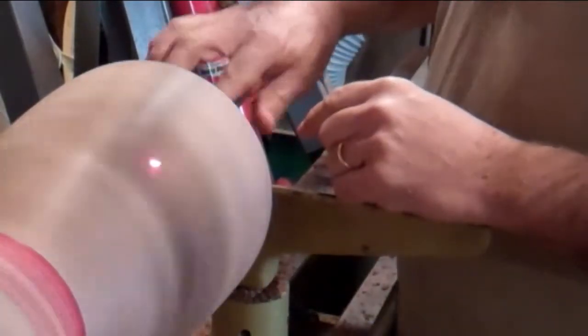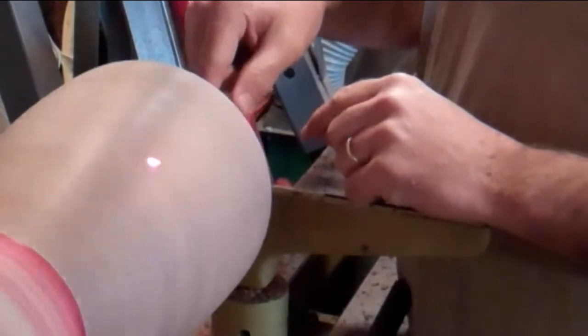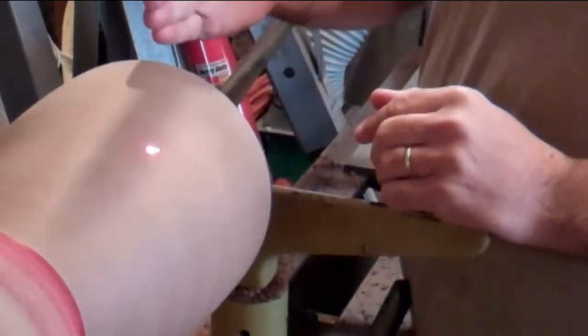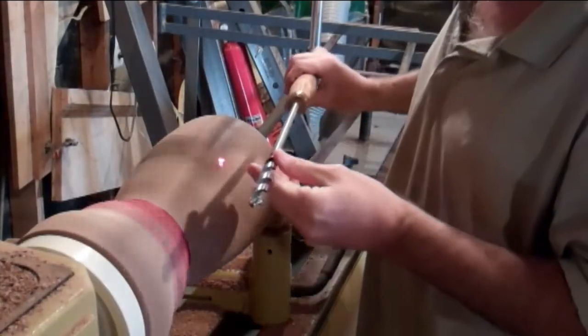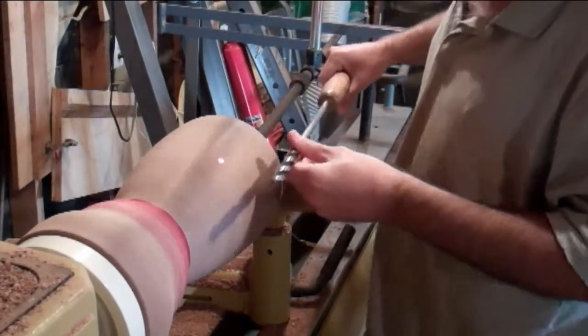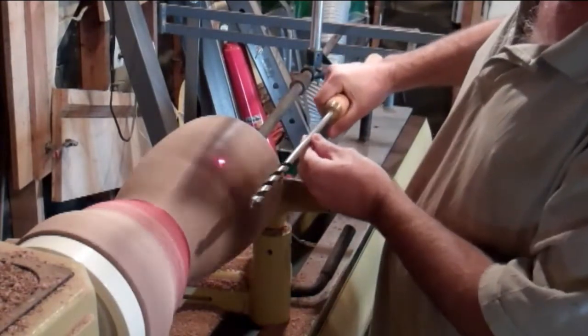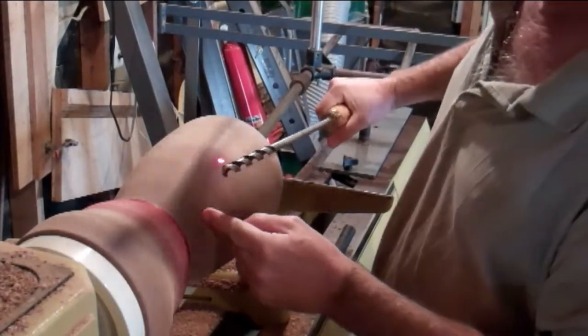Once they get down, the bottom is the only harder part. What I do is use a drill bit, and I drill down from the center. I drill all the way down and get my depth to the depth I want. I'm not trying to cut all the way at the center with this bar, because cutting the center all the way out is a little more difficult since it's so far in there. So I use a drill, I get my depth. I actually made myself a drill using a long drill bit, and I made a handle. When I first start, I can drill, and of course I measure and make a mark on my drill, and I drill down till it gets to the mark I wanted. You can see here, this one I drilled down to right in here. So I've got a center hole to start off with.